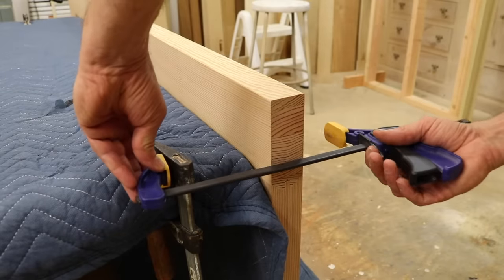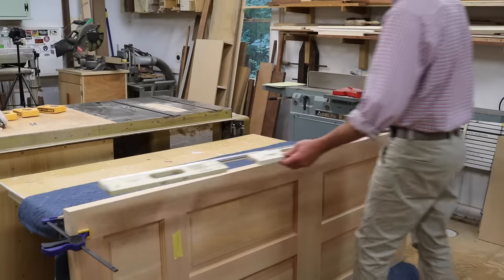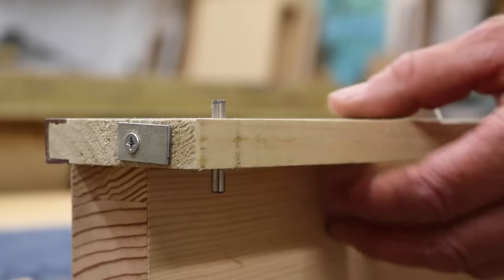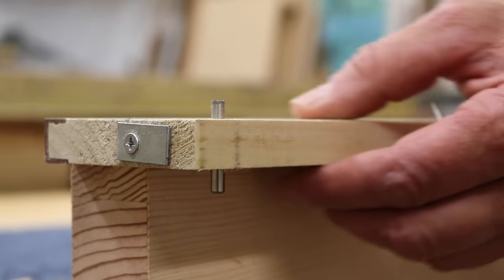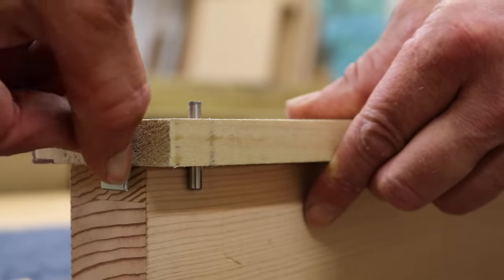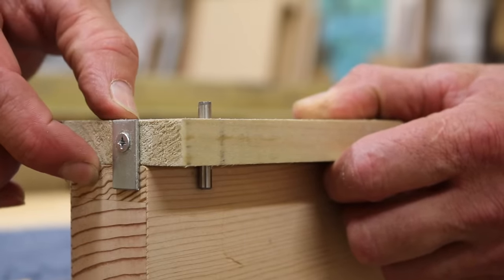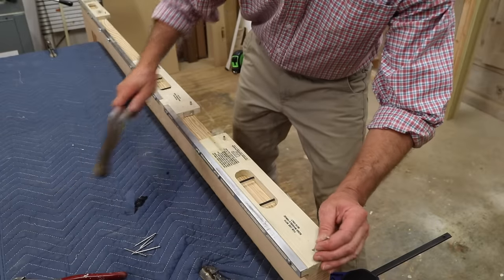It's helpful to take a minute and secure the door in position. Now I'll place the jig on the door with the location pins tight against the door front. Turn the spacer tab 90 degrees and pull the jig until the spacer tab hits the top of the door. Next I'll tack the jig in place.